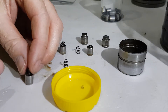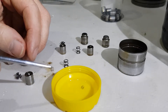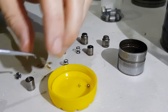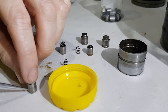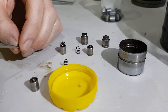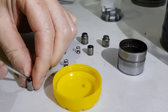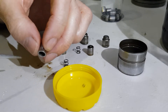Be careful doing it, because your spring may want to fly away. So that's it there — there's your spring and there's your ball. To assemble them, it's as simple as popping the ball back on once you've cleaned them all. Grab the little hat and the spring, pop it in — it picks up magnetically. Pop one corner in, just like that, pop it down, make sure it's all the way down, and check — all back together.